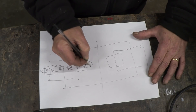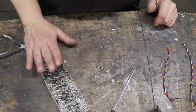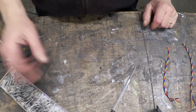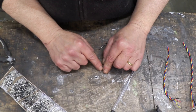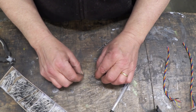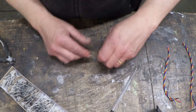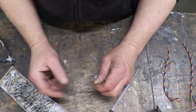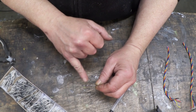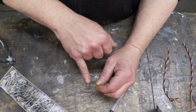This image helps visualize what it is we're actually doing. I have a lot of diodes — I bought a thousand diodes for seven pounds, so they're really, really cheap. You take three of them; obviously we've got a little silver band and a black bit, and all the silver bands point in the same direction. You twist them together like this and solder them, so we've got those two wires. Now what we have are four connection points — let's call them one, two, three, four.